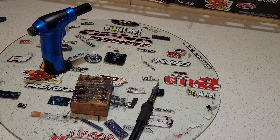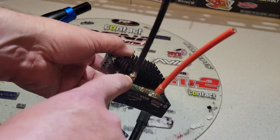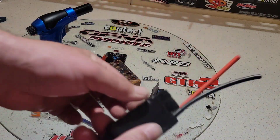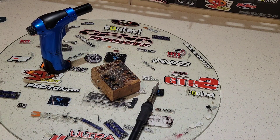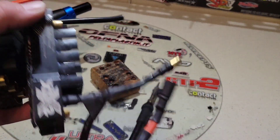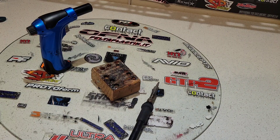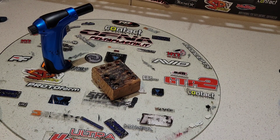So here it is — once you take the case off, that's what it looks like. I try to get down in there every single time — right there is where I come off. If you're going to take your capacitor and solder it directly on there, sometimes if I want a little bit of resistance I go up a little bit. But you just want it as close as you can to the ESC. It doesn't have to be right on that gold part, just as close as possible.